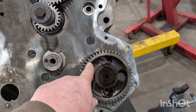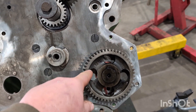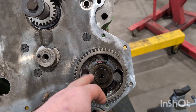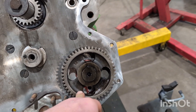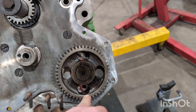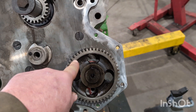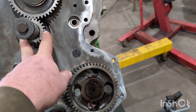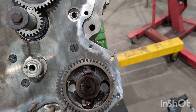Some of the cam gears here might have a two, four, six indicator on them. You go to how many cylinders you have — is it a four-cylinder or a six-cylinder — and go to that mark. But this gear just has that little tiny mark, so we'll put a straight edge across. The John Deere tool is a V-shape with a straight edge off the middle.